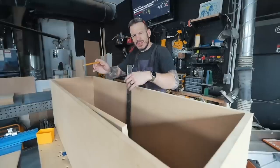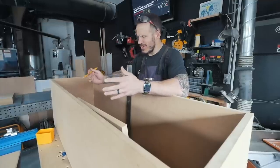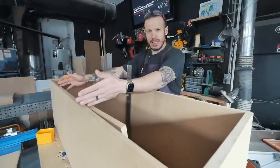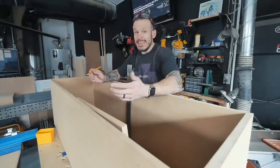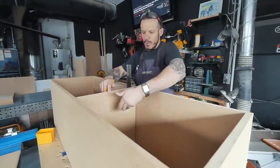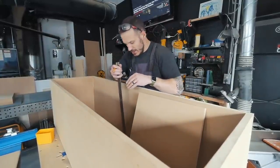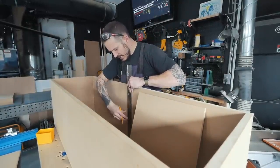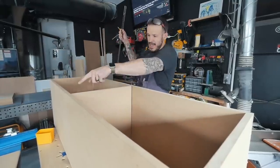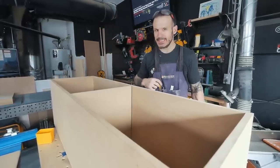Because MDF is a soft material, to prevent any issues torquing it down, I recommend countersinking a pilot hole before driving the screw in. Preparation is everything — make sure things are square. I know these are squared, but I need the support pieces that will act as shelves or drawers to also be square. If that plane is off, you'll have a nightmare installing drawers. So I use a framing square, register the base, slide it up, and line the next piece to it. Watch yourself on these bases — some of the most important mistakes are made here.